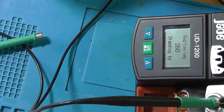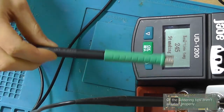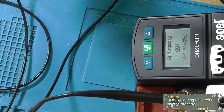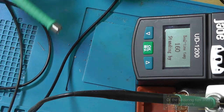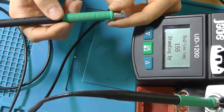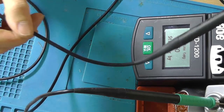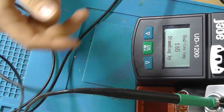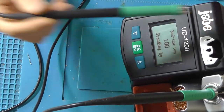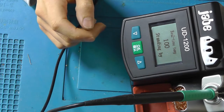The conclusion of this video: the soldering station is just fine — absolutely fine, there is nothing wrong with it. The handles are what's wrong with it. If you don't push in the filaments far enough, the positive pin — which is the middle pin — will touch the earth, and those two will touch. Then the wires inside the handle will heat up since all the current is basically flowing through the earth and the temperature sense wire, and that's not what you want. So buy other filaments and it should work. Or maybe buy other soldering handles as well. Insert them forcefully.